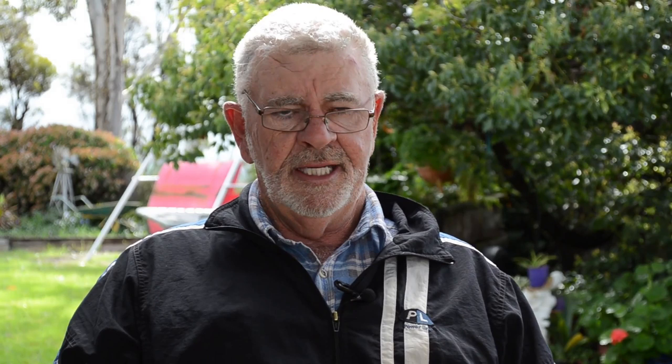For the whole system to work you've got to get those seeds in the front, so it's a pain but you've got to take all the straw to get it in the machine. We've modified it so that the chaff is now on top of the straw — we drop the straw on the ground, the chaff is blown back and deposited on top of the windrow so that it's always in the hottest part of the burn. This also makes it easier to keep the fire in the windrows when burning, and with only a short stubble left you've got a better chance of leaving some protection on the ground between the windrows.